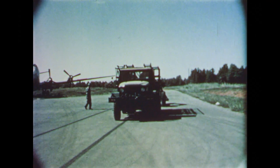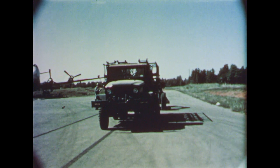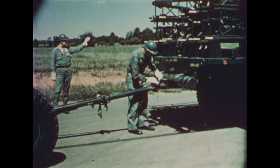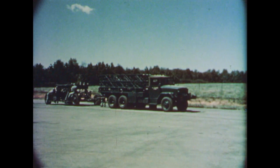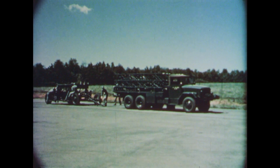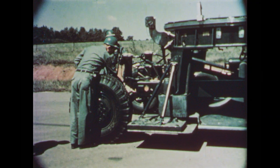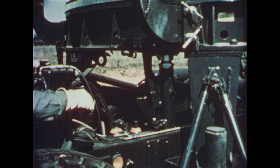Mobile erection equipment for the Jupiter missile is transported to a predetermined launch site on a 2.5-ton erector truck and a launcher on its transporter. The launcher trailer is uncoupled from the truck at the site, which should be reasonably level and firm with ample clearance for missile erection and equipment handling. Correct launcher towing position is indicated when two marks on the chassis form a vertical line.